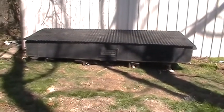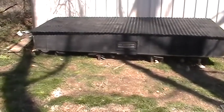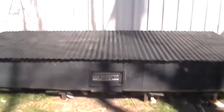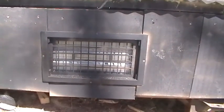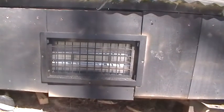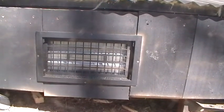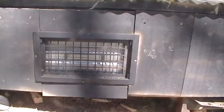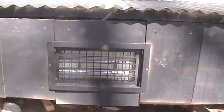This is my solar kiln I just built for drying wood off my sawmill. Down here is a foundation vent — one of those automatic ones that opens up at about 70 degrees. If you take the pin at the thermostat and pull it out and turn it just a little, this thing won't open until 90 to 100 degrees, which is about what I got it set at. I've painted it all flat black so it gets real hot.